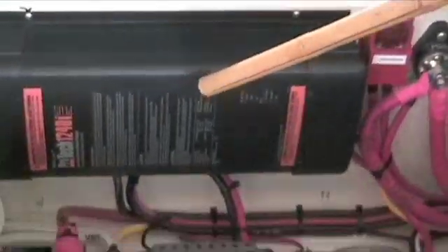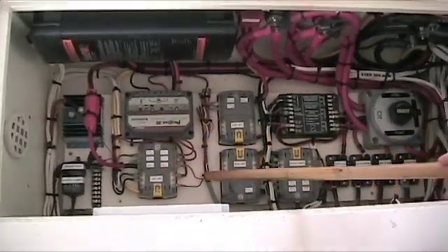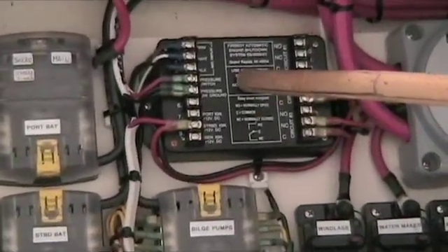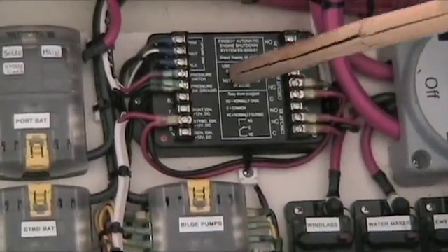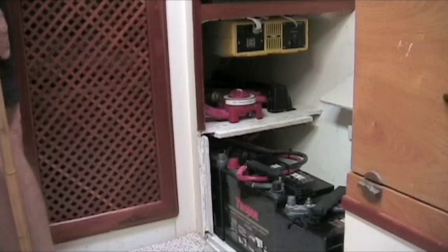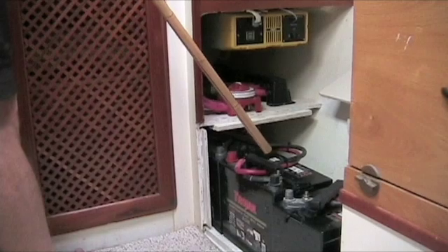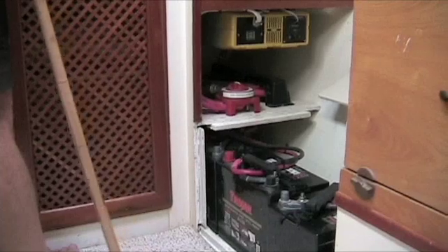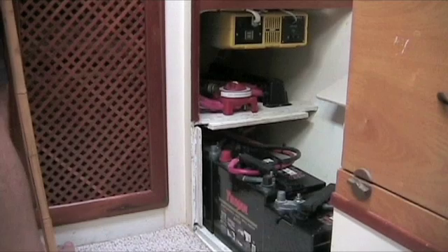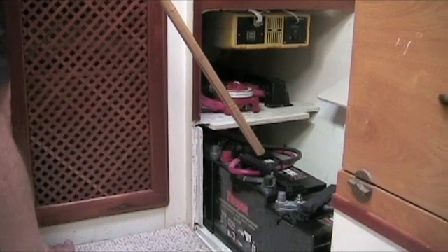While we're here, let's look at what else is in this compartment. This is the solar charging regulator. We have several fuses for all the services on the boat. This is the control for the automatic fire extinguishing systems in both generator lockers. And this is the house battery bank selector switch. For redundancy, we have two house battery banks. This is the starboard battery bank. Each house battery bank contains six batteries, giving 480 amp hours of storage.